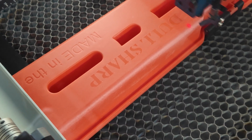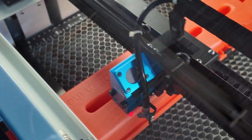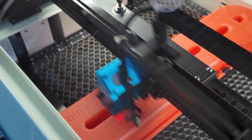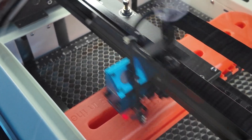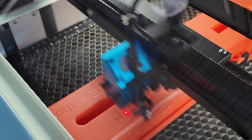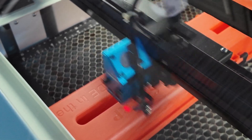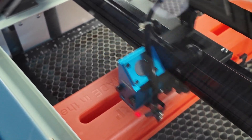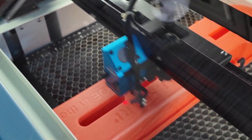They provided me a tech sheet. I took a look at the tech sheet — there was a big long UL number, which stands for Underwriters Laboratory. I was able to trace it back to the actual manufacturer of the plastic itself used to injection mold this product. I went to their website, pulled it up, and found the safety data sheet to find out what was in this plastic and whether or not there were health hazards associated with it. Fortunately for me there weren't, but I also found that many products have additives that create toxic fumes when heated.